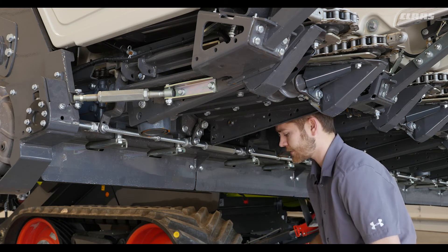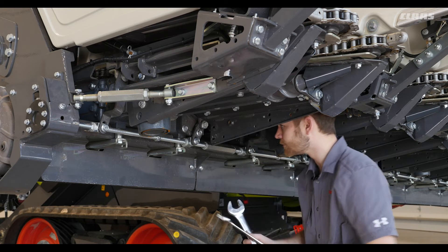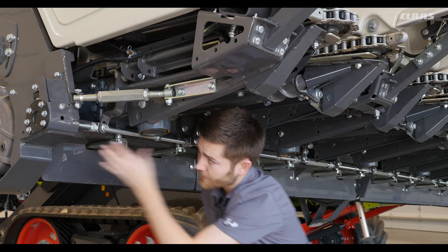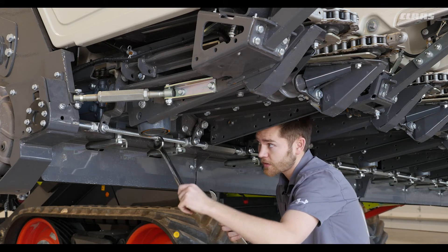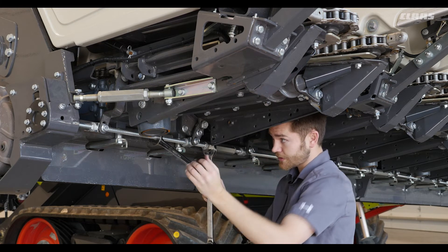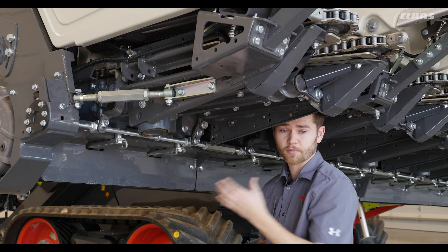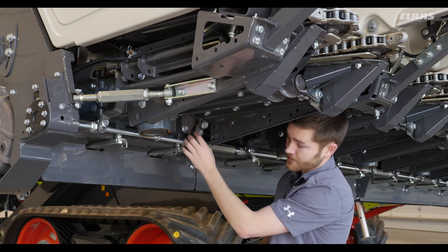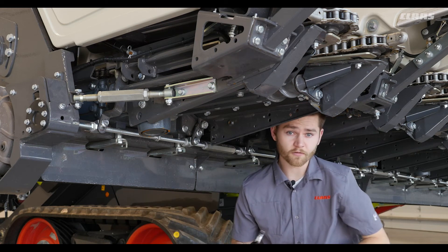We're on the right hand side of the head. We'll need a 30 and a 24. Looking at this turnbuckle we'll loosen this jam nut and then the jam nut on the other side, so we can make adjustments to the right and left hand side. Once we get that adjustment we'll put our 24 on the jam nuts in the center of that threaded rod, then position the rod by spinning the turnbuckle. That'll move our deck plates left and right, and we can make fine adjustments by undoing the two jam nuts on this linkage for both the left and right hand side. We'll have to do that for each individual row unit.